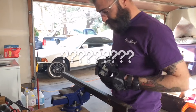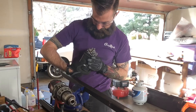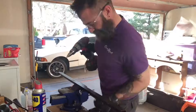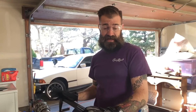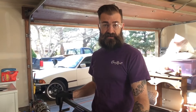I'm going to be using 1.25-inch hardware to fasten all the cross members onto all the legs, so I'm going to use a drill bit just over a quarter inch - about 9/32 - to do it. I measured out the distance for the cross members between each one of the legs - that's about 16 inches, which works out perfect because these braces for the bed frame are each 33 inches and have holes drilled on either side already. So I'm just going to cut the 16 inches out of these and use them for the cross members.